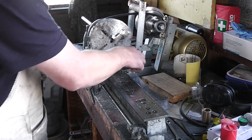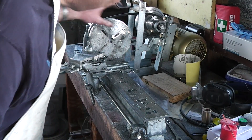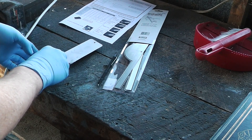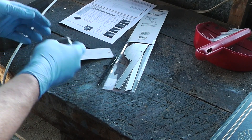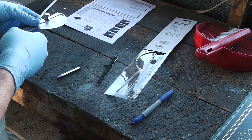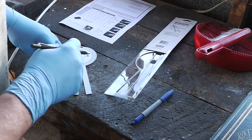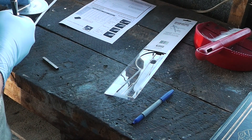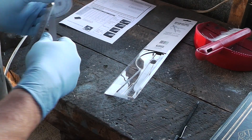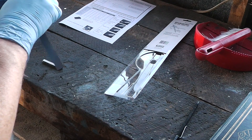You'll never guess why this was flexing — this screw here holding the cross slide ways had come loose. Just going to try my hand at grinding a lathe tool, one specifically for aluminium. Side relief is 12 degrees, recommended for aluminium — it's barely visible. Side rake recommended is 16 degrees. As per usual I don't know what I'm doing. 35 degrees back rake.